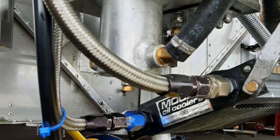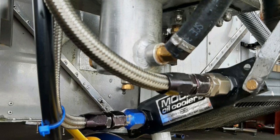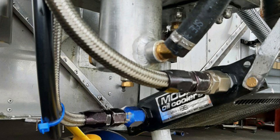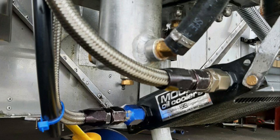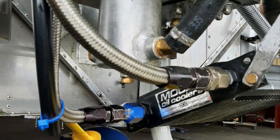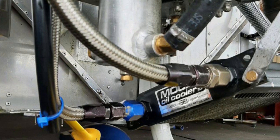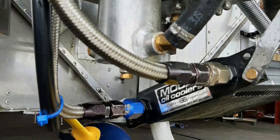Some oil tanks were welded together top and bottom, and some were glued together with a groove and the right sealer. Those glued together will not have any cracks, but sometimes will have to be resealed. Those that are welded together should be inspected regularly for fine cracks along the welds. If found, the tank should be removed, welds fixed, and plates welded, as we show around the tank, for additional support. All this work, of course, is available, as we support these engines at Viking as well by shipping the parts here.